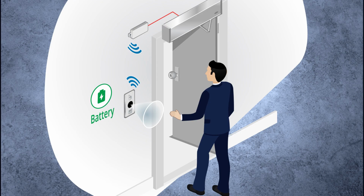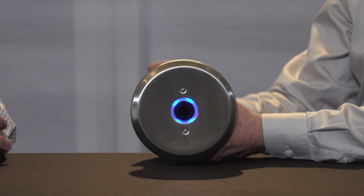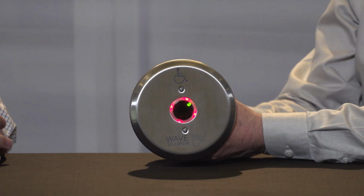That's right. If you're using this product with our CM331 or CM332, just the wired models, you can order it with the illuminated ring as well. Is color adjustable? Yes, it is. You can actually choose from one of 3 colors, red, green, or as you can see, the blue color. And you can have it set to change color by your hand, as you just demonstrated, or by remote activation from a relay or access control system even.